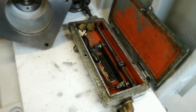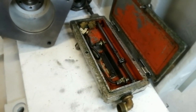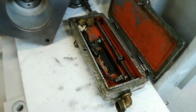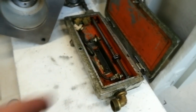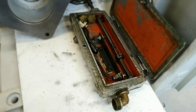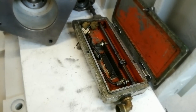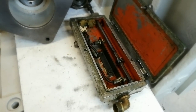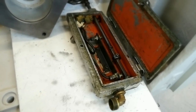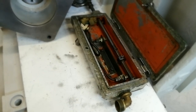It's similar to a manual machine - it's a hydraulically driven tailstock. You drive it up into position, clamp it, and this box controls the spindle itself. On a manual machine you're moving the tailstock and adjusting the spindle in and out manually, but this is hydraulically driven with limit switches at each end for minimum and maximum travel. You set your guide to how far you want it to travel. I won't use it that much - it's more for shaft work or longer supporting workpieces - but it's still handy and I'll be rebuilding the tailstock as well, replacing seals and things since it's a hydraulic unit.